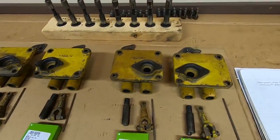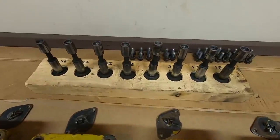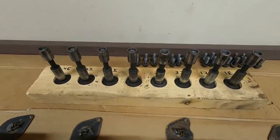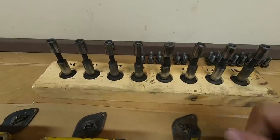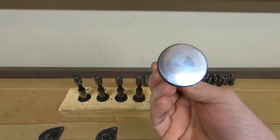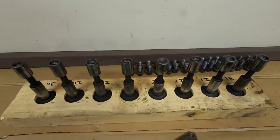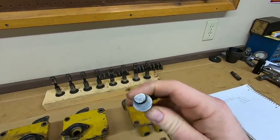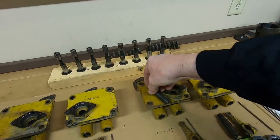After quite a lot of disassembly and even more cleaning, I've been able to give everything a good look, and honestly I'm liking what I'm seeing. I swapped out for a wooden two-by-four holder for all the lifters — an inch-and-three-eighths spade bit on two-inch centers set to a fixed depth on the drill press makes a really nice holder with a good friction fit. As you may remember, water ingestion was a bit of a problem with 1113. Some lifters suffered a little water staining, but they all look really good where they contact the camshaft lobes and they all slide well in their bores. I also got a good look at all the decompressor shafts with that little cam on the end that acts on the lifters — just a little bit of wear on the leading edge, but the 1113 originals really aren't bad at all.